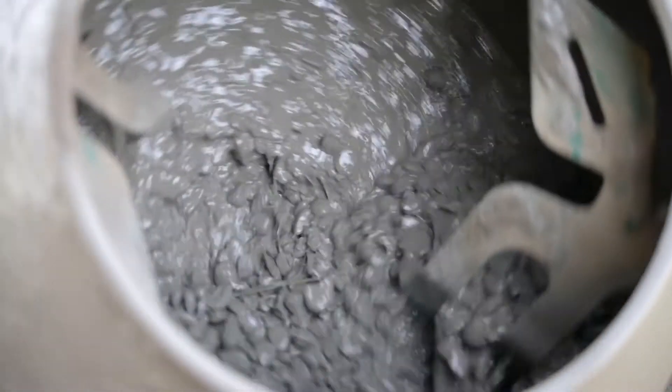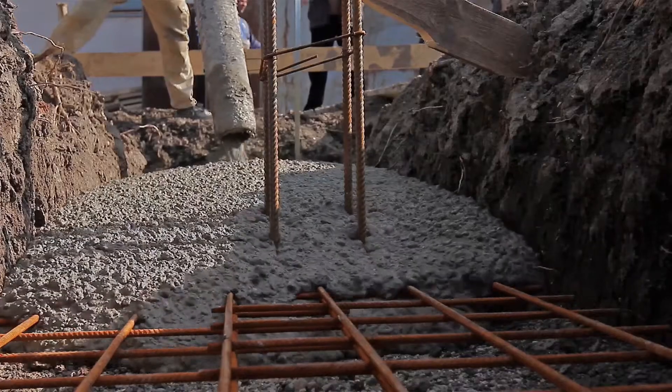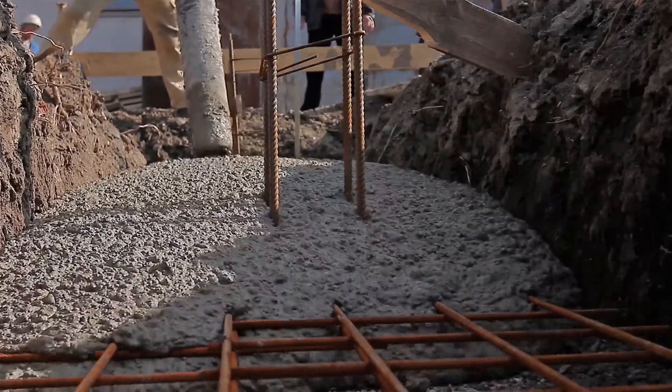When we talk about the concrete mix, you've got almost 30 years playing with concrete mixes. Low shrink mixes are fun because it's a bit of a challenge. It all starts with the idea that mortar shrinks, coarse aggregate doesn't typically. So we want to maximize our coarse aggregate content in the mix — get just as much rock as you can into that concrete. The way to go about that is by approaching a total gradation design using something like Shilstone or Tyler Ley's Tarantula Curve, where you get as much coarse aggregate as you can in there and still allow that concrete to be placed and finished properly.